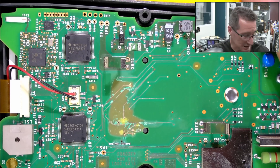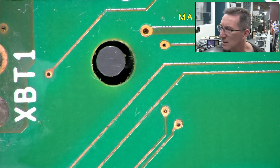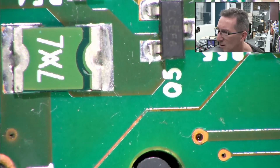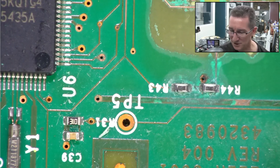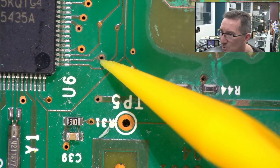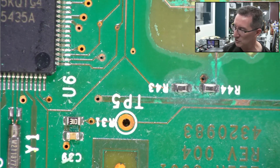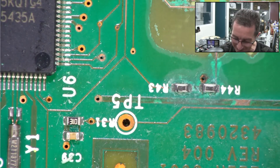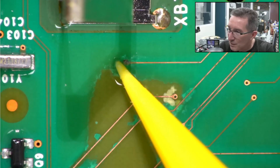I think they will work. I don't see how it's eaten through any of those traces. The only concern here is long-term — has it been eating away there under the solder mask? And you can see it's almost made it to the main MSP micro over here. I need to clean that up better — I should use better than just a paper towel, like a lint-free wiping cloth. And that via there is black as — look at that sucker.